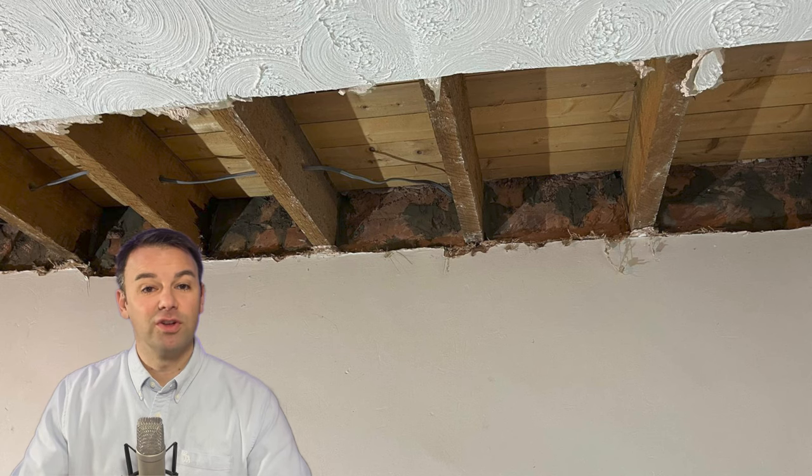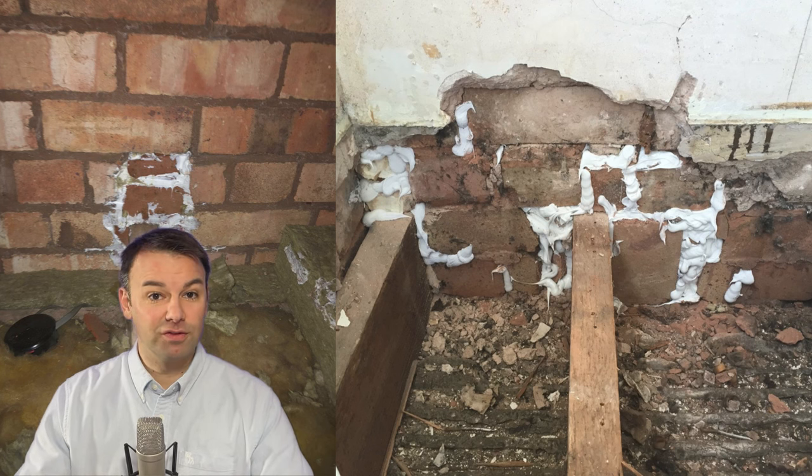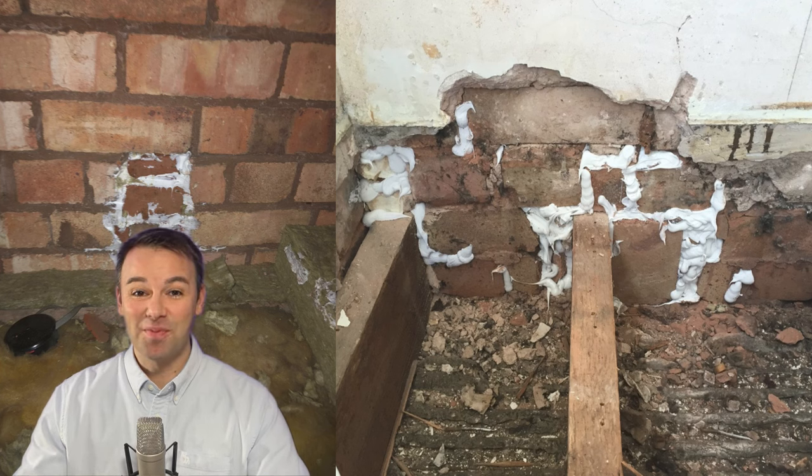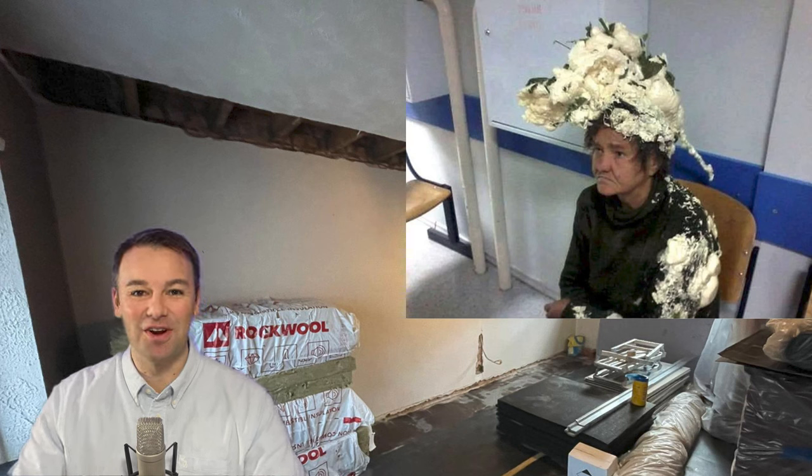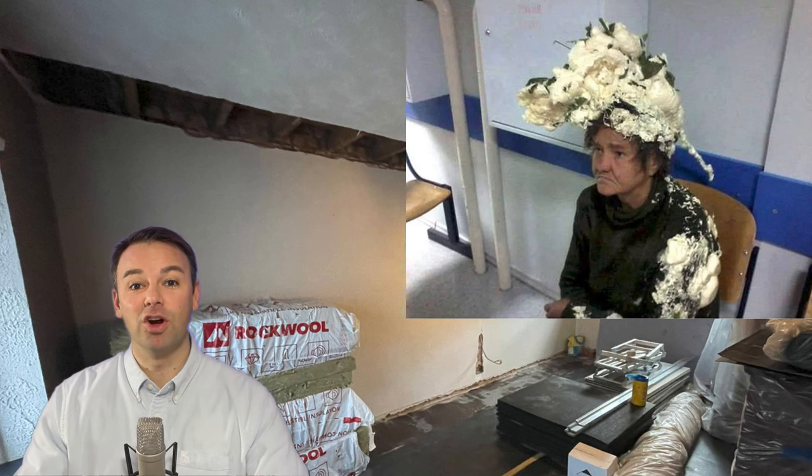To brick up those holes, we're simply going to fill them with sand and cement. For more difficult to reach areas you could also use an acoustic sealant. Some people might choose to use an expanding foam — I'd recommend don't use that expanding foam, even the soundproof version. Expanding foam will cure and the sound will travel very easily through it compared to sand and cement or an acoustic sealant.